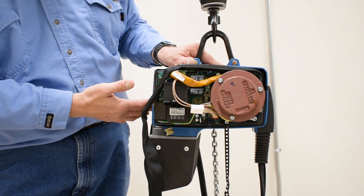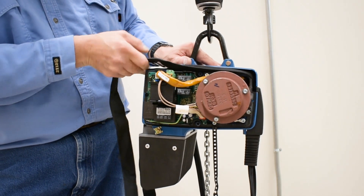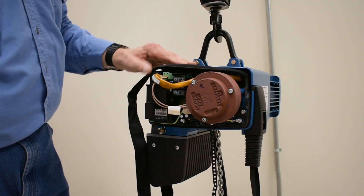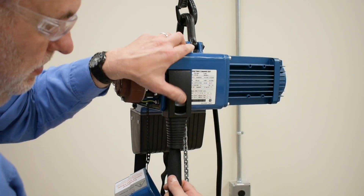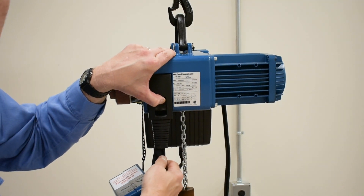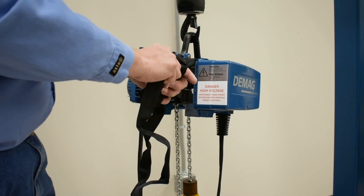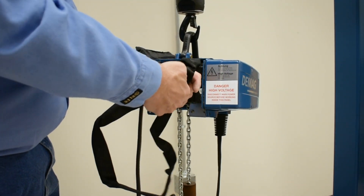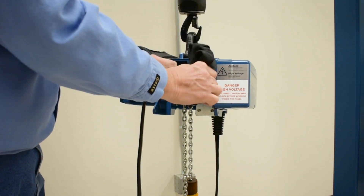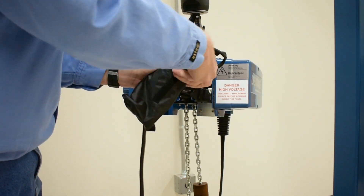To change the cable length for operating height of the pendant, we leave the cable in the groove. We'll undo the thumb clamp and make an adjustment. Releasing the thumb clamp will allow us to pull on our cable to get extra length. You can work it from either side. When dealing with the extra pendant cable, it is a very good idea to take a few moments and fold it neatly so that all the excess cable fits nicely into the supplied nylon bag.